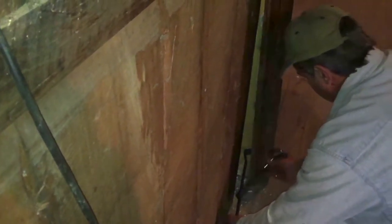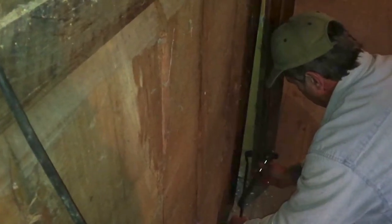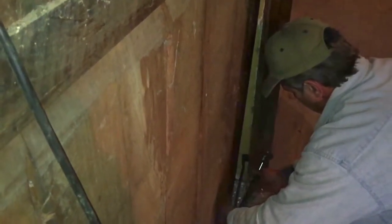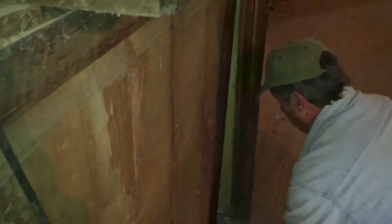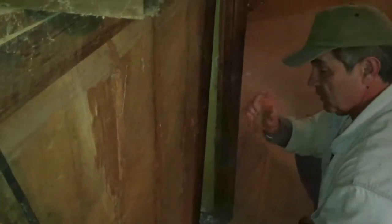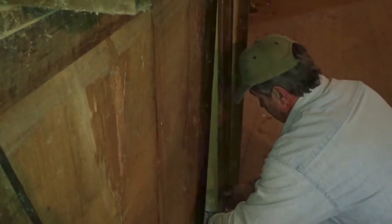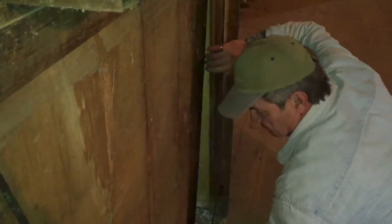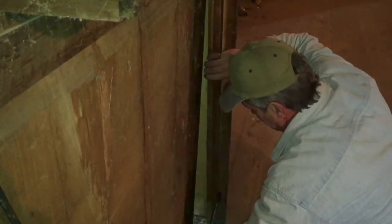All of the wood in the house, the floors, the trim, the doors, it is a type of fir, a pine, but it's really, really strong, really heavy. I mean, each of the floorboards, I was surprised, being that it was a fir, that they were so dense. Yeah, that is a quality of old wood that is not what you find in construction grade lumber nowadays. It's now fast growing trees, so it's very wide spaces, and that makes it a little more susceptible to insect damage. This old stuff is so old, so tight grained that the termites and woodworm can't really get into it.